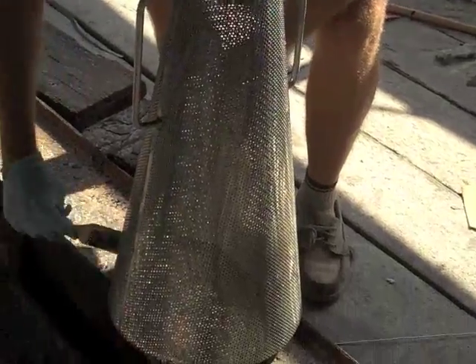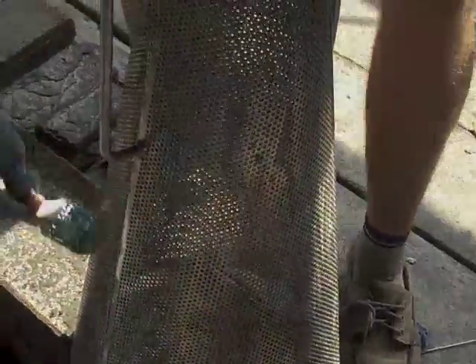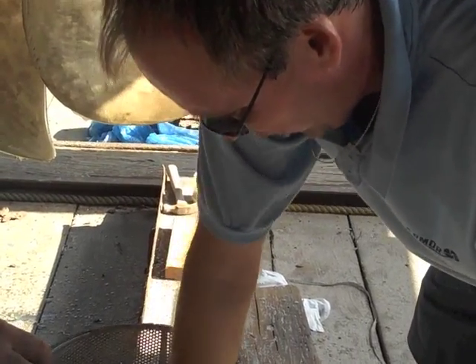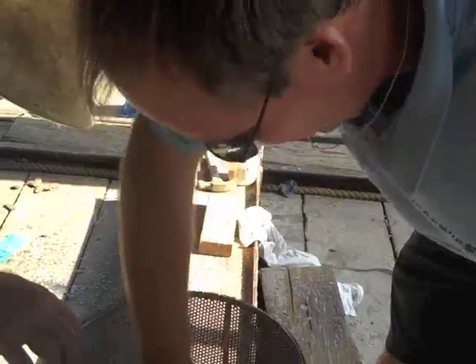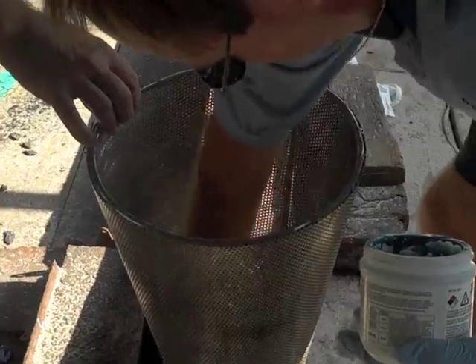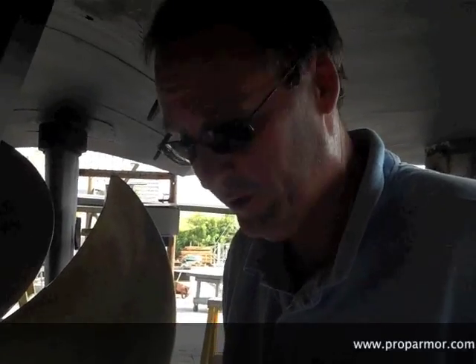Most engineers on yachts that I've talked to who are using this absolutely love it — it saves a lot of time. You can see how I've applied it. It's kind of hard to see simply because it's a thin coat, but that's all you need. Now, not everybody has a shrink-fast heat gun as we do. A small heat gun will work, although it'll take longer. You can also apply Prop Armor cold — you'll have to buff it in, similar to buffing a car, but you just keep buffing it in without wiping it off. On your last second coat, just make sure that it's thick and you don't buff too hard. But again, this is the preferred method to apply it. I encourage you to give it a try — I think you'll really like it. Thanks for your time today and enjoy Prop Armor.